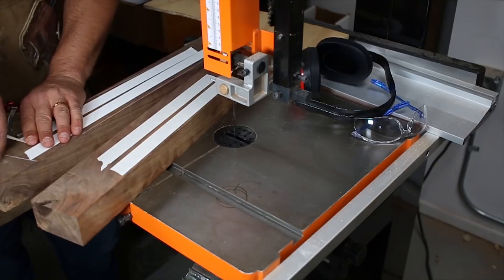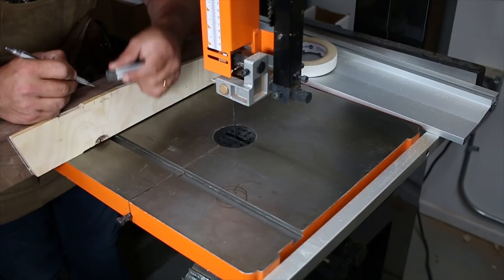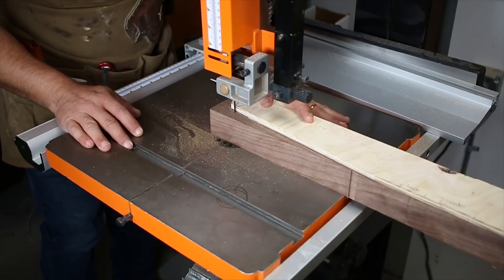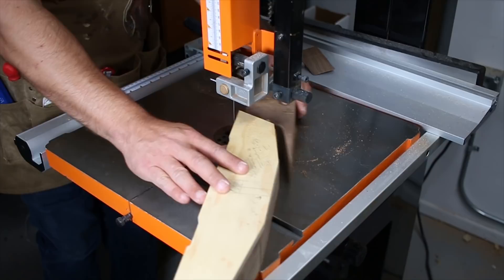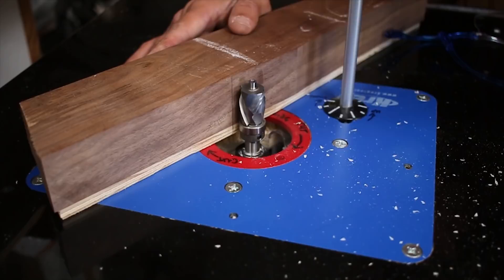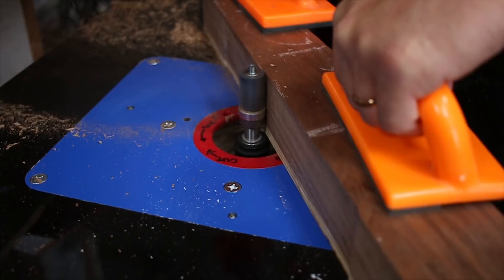Then with some double stick tape I applied my templates to my stock material. A great little tip here is to use the table of your bandsaw to make sure that both the bottoms are flush. I then trimmed my stock up so it was close to the template and took it over to the router table. I use this flush trim bit by Whiteside — it's a double bearing bit, I'll leave a link down in the description. This thing is a beast; it tore through everything like it wasn't even there. I took the top bearing off so I could route with the grain, then flipped the piece over, put the top bearing back on and removed the bottom one so I could do the same thing. This allowed me to route safely around the entire piece.